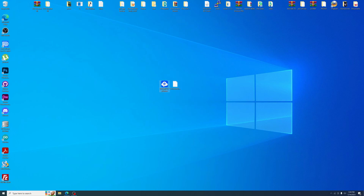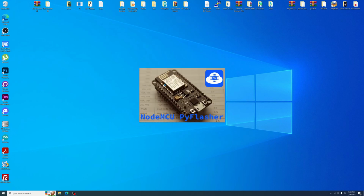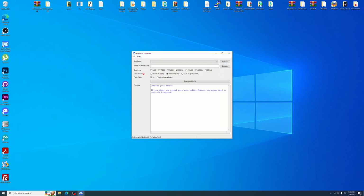Okay, so now that we have it downloaded, it should come in a bin format. We'll also need the flasher. I will leave a link in the description for that as well. We'll open it up, and once we do get it open, our first option is the serial port. Now I know mine's COM4.